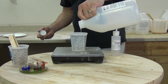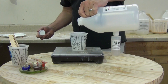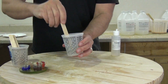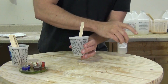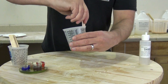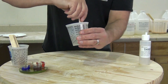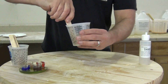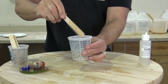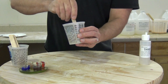Personally, on a product like this, I like to use a scale and do this one-to-one by weight, all in one container. That minimizes waste, keeps everything accurate, and reduces cleanup since you don't dirty up a lot of different mixing cups. As it comes, when we mix our two parts together, 5110 and 5110F are both very low-viscosity silicones, great for small block molds or one-piece molds that in many cases you can pour without vacuum degassing.